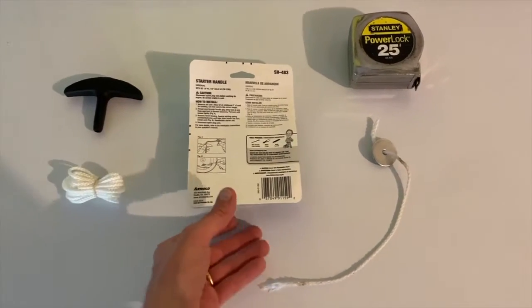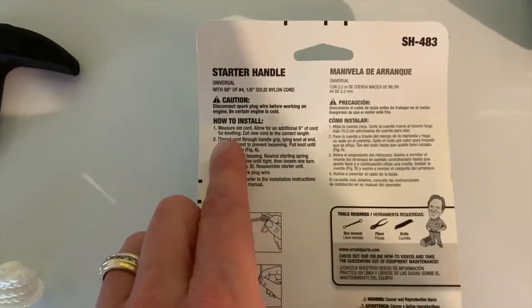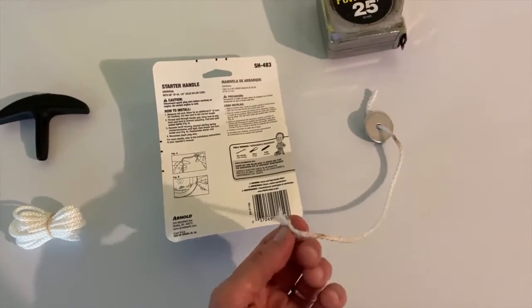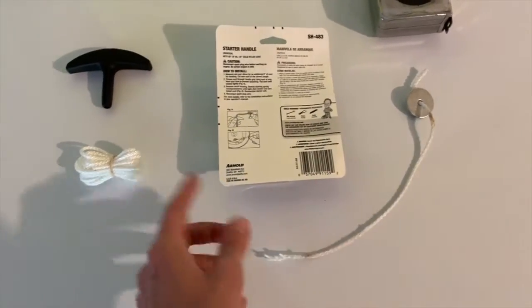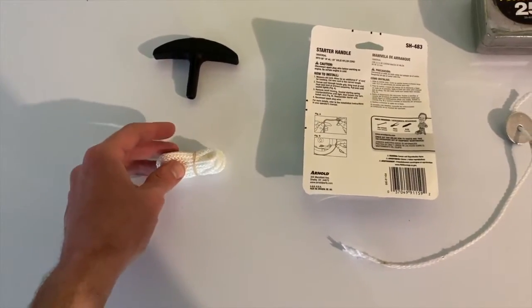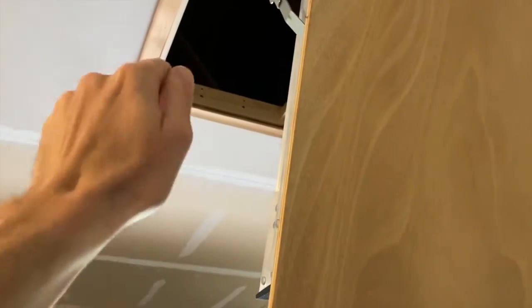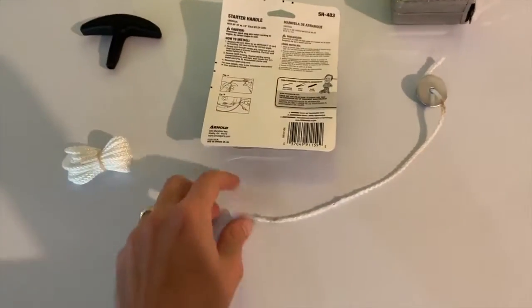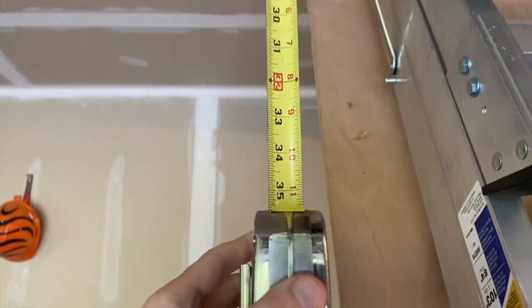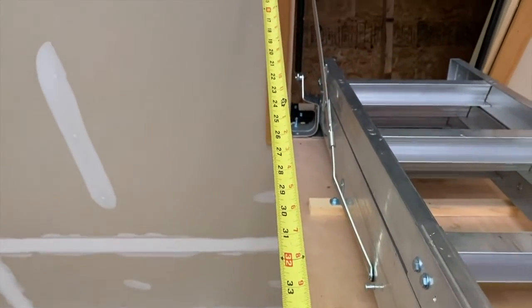At the workstation now — on the left hand side, new rope and new handle. On the back of your packaging are your instructions. Here's my old snapped rope. Step number one: measure old cord and allow six inches for knotting. Unfortunately we don't have the opposite end — hopefully you do. Measure your two ropes: both the snapped portion that is secured with the washer and the opposite end that has your handle, and cut the new rope to that exact same measurement. Since we don't have the other end, we're going to use our tape measure, head back to the ceiling, and measure arm's length — basically three feet down. It's also important to purchase the proper size rope, because if you purchase a rope that's too thick, you'll either have to drill the hole larger or go back to the store. I've measured 36 inches from the ceiling, minus six for the knotting — that gives me 30 inches, which is perfect arm length for our rope.